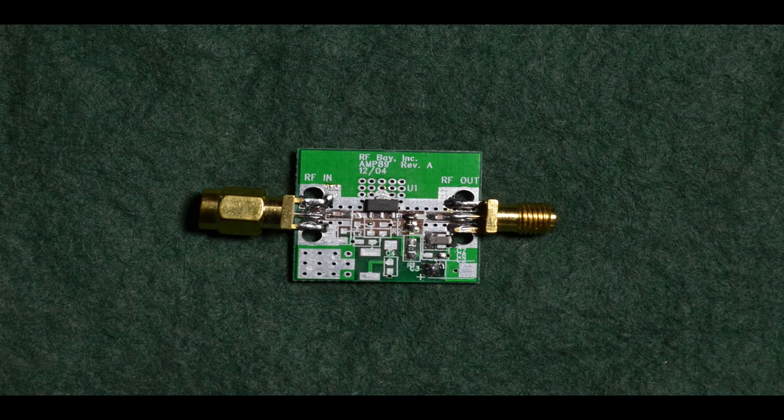Now, one way of improving the output is to use an amplifier. The amplifier in the picture uses the same device that DATV Express uses on its output. It's in fact a GVA84+, which is a 7 gigahertz device, and in the 2.4 gig band has about 20 dB gain and will produce about 100 milliwatts output. So adding that to the output of the Pluto will probably bring it up to a level that is adequate to drive amplifiers, certainly if you've used DATV Express before.